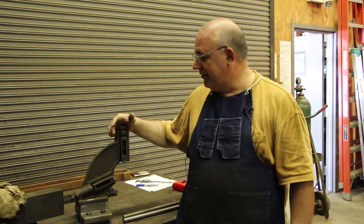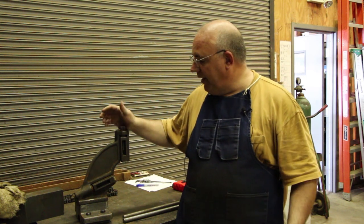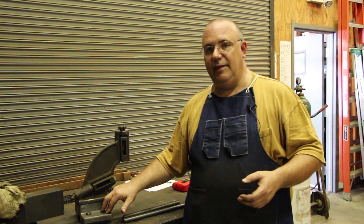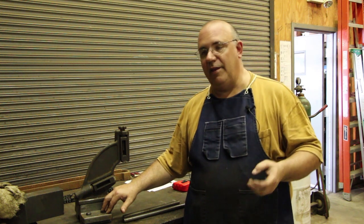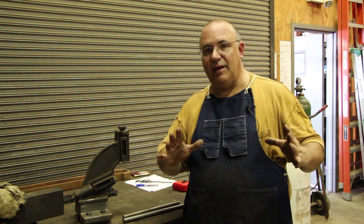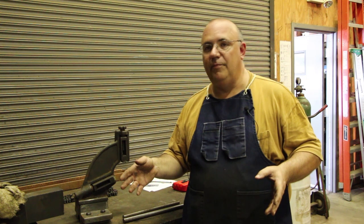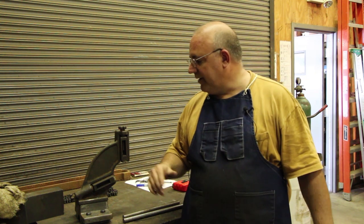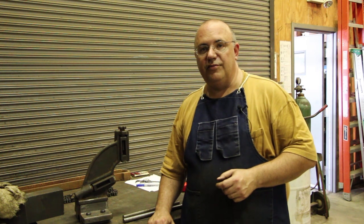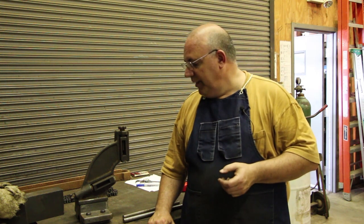The reason I wasn't using a steady rest is I didn't have one. This is a steady rest for a Lodge and Shipley 16-inch Model X lathe. Actually this one is off an earlier Lodge and Shipley lathe — I can't remember the exact model number. The Model X's were introduced sometime in the 1940s, but previously Lodge and Shipley made a very similar lathe, with the exception of the headstock gearing. The carriage was more or less identical, but they upgraded to a slightly different gearbox design in the headstock.